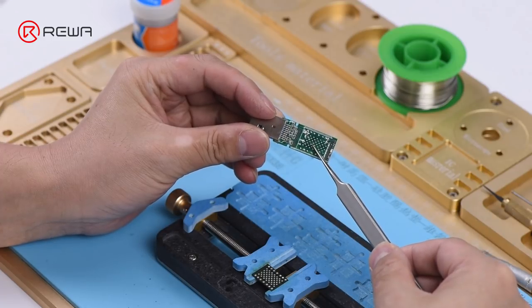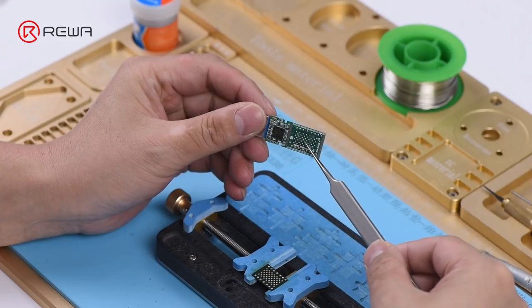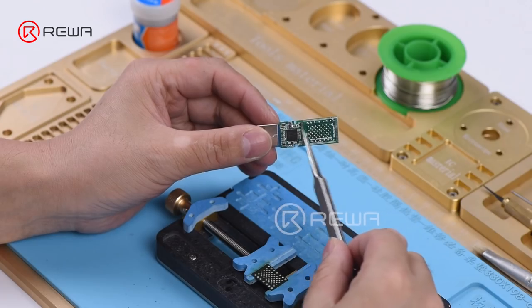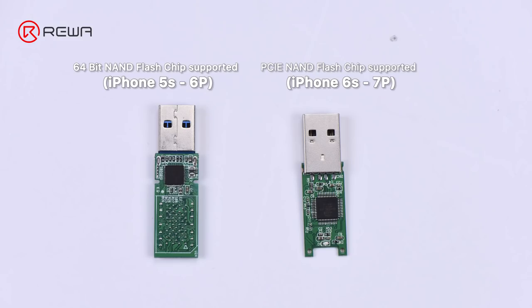For example, two 16G NAND flash chips soldered contributes to a 32G USB flash drive. If you want only one NAND flash chip soldered onto the bare USB flash drive PCB, then you can only solder the NAND flash chip onto the side where the mass storage controller is located.